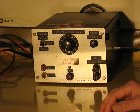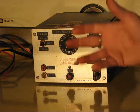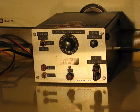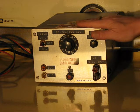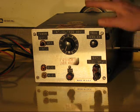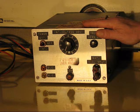It'll do about 1 or 2,000 microamps, 1 or 2 milliamps, which is not too bad. Continuous. It was enough to fire up the laser, but it does have other uses. Obviously, charging capacitors would be one of them. It uses a flyback, liberated from a computer monitor.